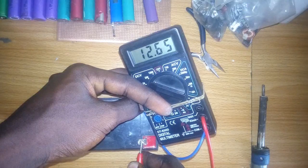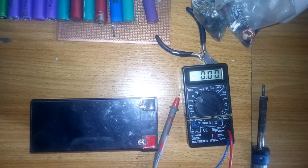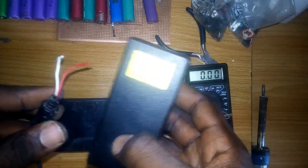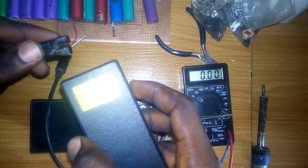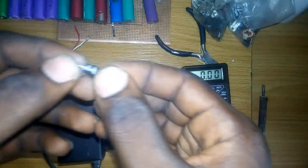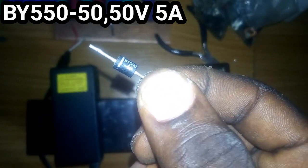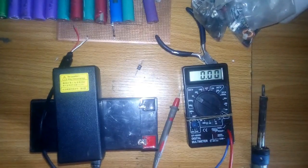Right now the battery is not so low — there is some voltage. I'm going to be using an adapter. You can use either a switching or linear adapter to charge the battery. Make sure that the adapter has a current capacity of 3 to 5 amps and is either 15 volts or 16 volts. I'm also going to be using this diode — it's a BY550-50, rated at 50 volts and 5 amps. You can get this at your local store for maybe two dollars or less.